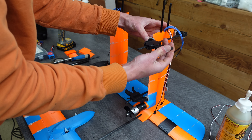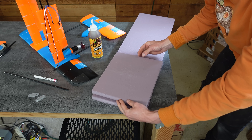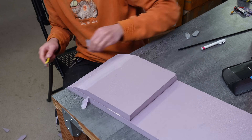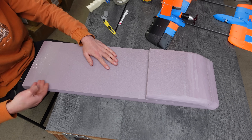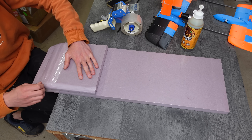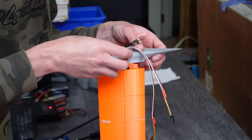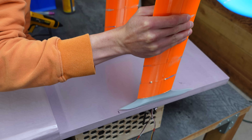Next it was time to figure out something for the fuselage. I decided to go with inch-thick XPS insulation foam — it's easy to work with. I made a step in the front so that it's more like a seaplane float; the step helps reduce drag at speed. Then I shaved down the bow into a nice curve and put packaging tape over the whole bottom because it's extra slippery in the water. I ended up printing too many mast sections, but decided to just add on the extras — so now it'll be a little taller than originally planned. Some end caps got glued onto the foam board with the wires routed through holes in the foam.